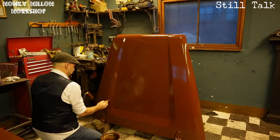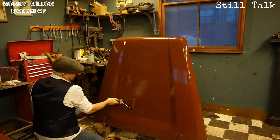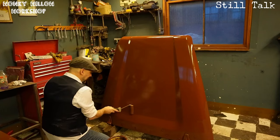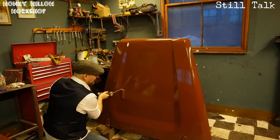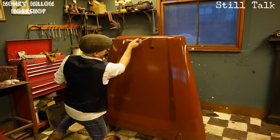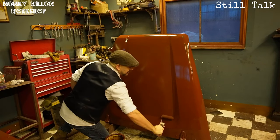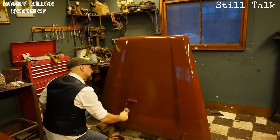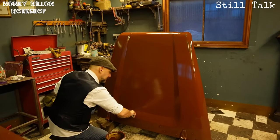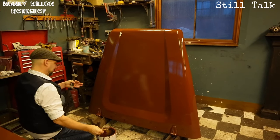So we've got quite a big area here, and basically just keep moving. It's not really about the direction because there's no grain — it's all about whatever direction you need to go to get it smooth and even. You'll start to see it because of the bubbles: where it's deep, you'll leave bubbles in it. So that's basically just ready for laying off now.